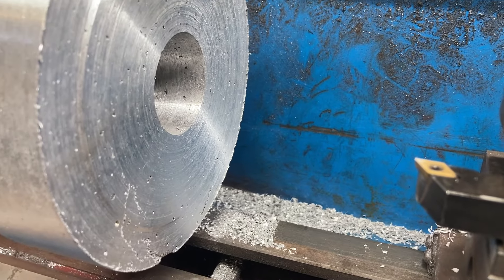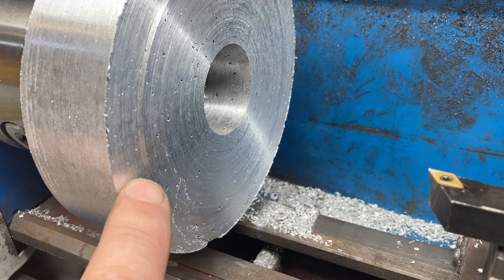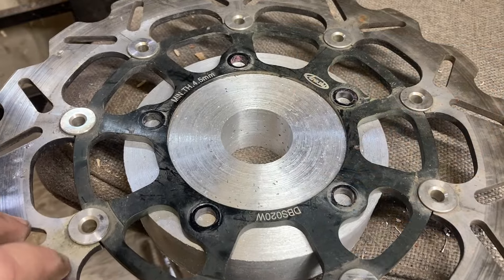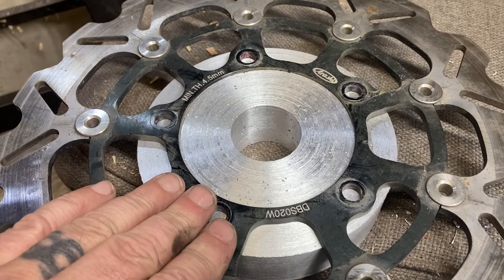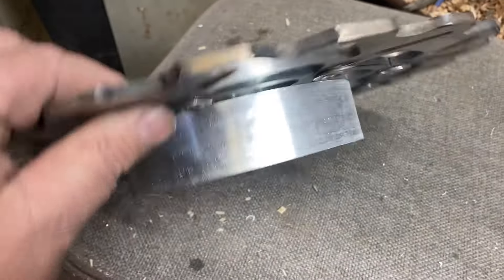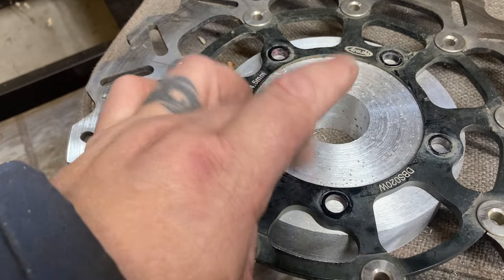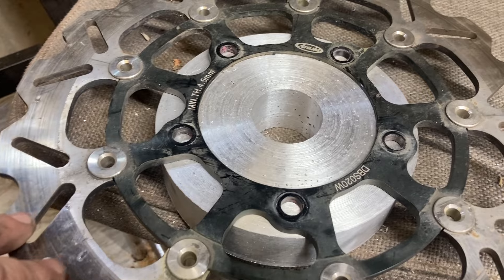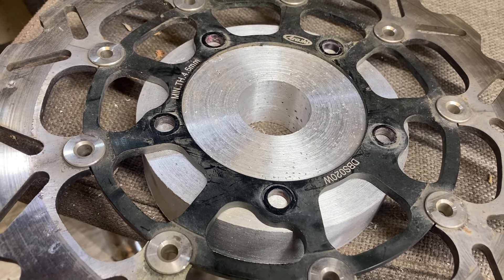I'll machine this shoulder in here and show you what I mean. By creating that shoulder I've made it so the rotor can go on this piece of metal. We tapped it into place, it's all in there nice and tight and stuck together. So now we can drill through these holes and get our bolt pattern into this piece of aluminum without things wiggling around and flopping around. Hopefully everything will be nicely lined up — maybe more precision than anything that usually comes out of this shop.